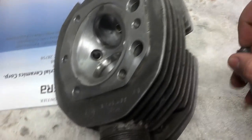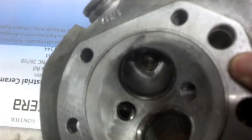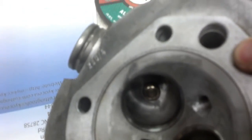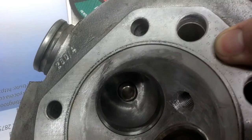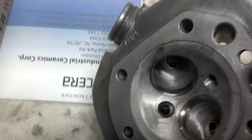I machined it off so that I had a little guide so when I go to screw it in there I can tell exactly where to start. You can see where I ground the threads off to — they still look perfect above it. I just ground them off so that they wouldn't cause detonation.